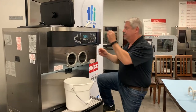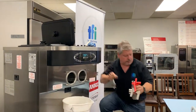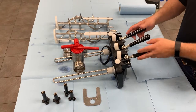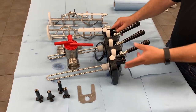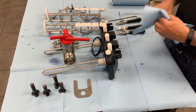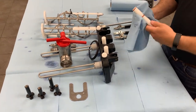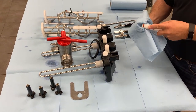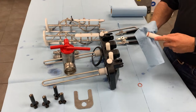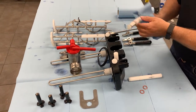The next thing I'm going to do is pull the pump out, which we've already disconnected. Now for the freezer door disassembly: we first have a keeper pin that we're going to pull across, lay down, and we've got our three draw valve handles that come out. We then have our draw valves which I will pull out. There are o-rings on these that we have tools to remove that come in your tune-up kit, or you can also do an old method called pinch and roll — where you pinch the o-ring and roll it out. The reason I'm removing these o-rings is because there are square grooves that these o-rings go into and we have to clean and get the bacteria out. All of our draw valves have different kinds of o-rings.